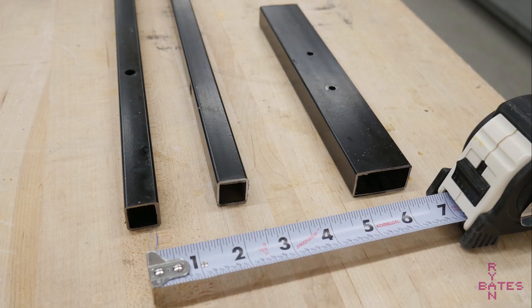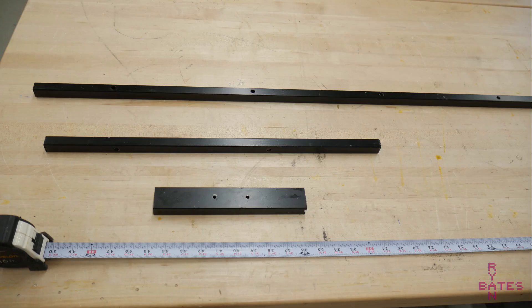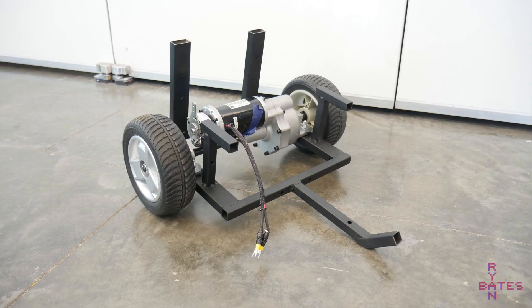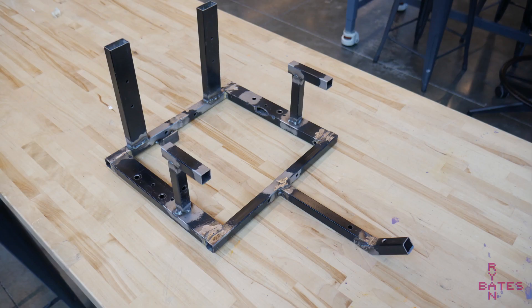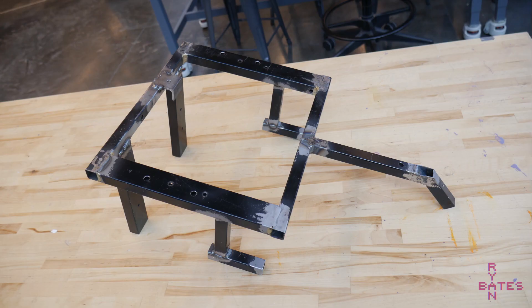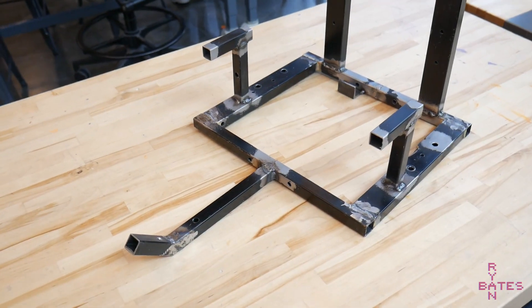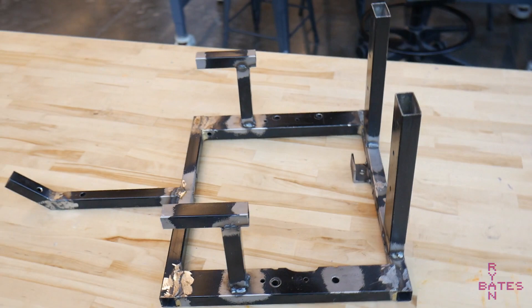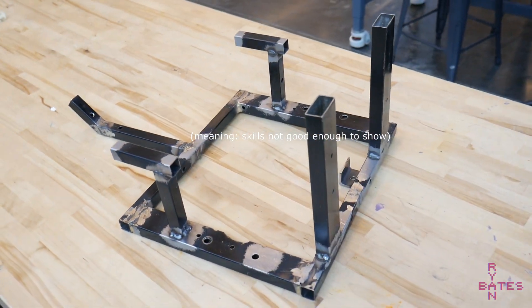This mechanical lever lets you disengage the brakes for an all-gas, no-brake setup, which is what we're doing here. The next thing you need to do is find some metal. I'm under some budget constraints, so buying tube stock is a no, but I did find this coat rack in the dumpster about a year ago, which happens to be 18-gauge square tubing. It's free metal, but we have to do a bit of cutting and sandblasting before welding up a frame. This is the frame welded together — I didn't film any of the welding, grinding, sandblasting, or cutting because I care about this camera.